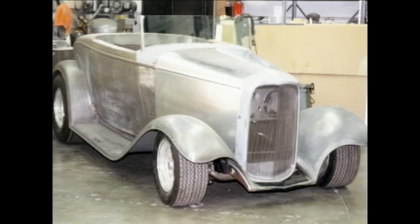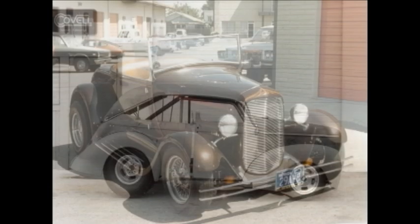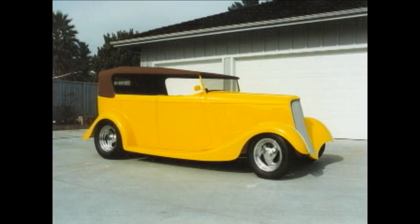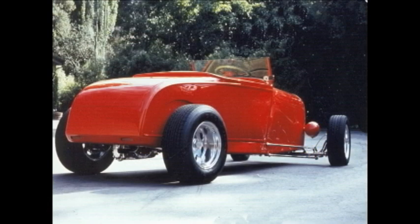A lot of the work that I do is body work on cars and bikes, and the TIG welding process is ideal for this. Many people use MIG welding for body work, and while it's strong and it's fast, there is a major limitation: the weld bead is brittle. If you do very much hammering on a MIG weld bead, it's liable to fracture. The TIG weld bead is considerably softer, and I can hammer on it quite a bit with no fear of it cracking.